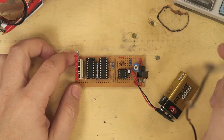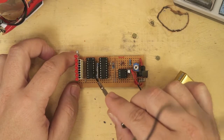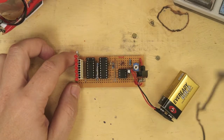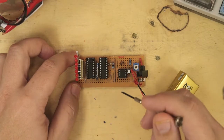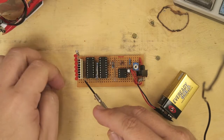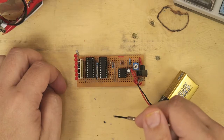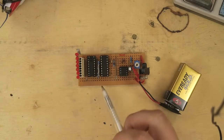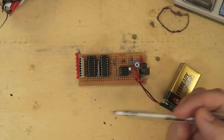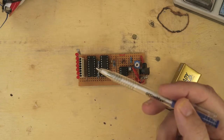So it's comprised of these three chips really. We've got an output chip here, the ULN2003, so this is the guy who does all the heavy lifting. It'll turn on, like I say, 500 milliamps per pin, which is huge. So this LM3914 is like a VU chip. It measures any input voltage and the amount of voltage going into it. It turns on up to 10 LEDs.